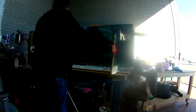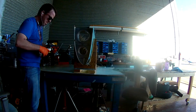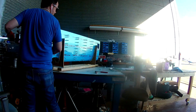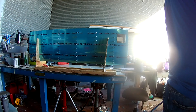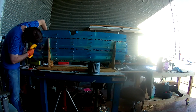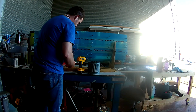As I put the ribs in — you put the skin into the holder, put the ribs in, click it on. As I'm doing it, my mind is flashing back. It's kind of like a war reflex: oh God, do I have to mix sealant? No, I don't. I mean, don't get me wrong, I like the sealant, but Jesus. So you put the ribs in and then you slide in the J-channel. You have to line up that pre-drilled hole that you made earlier and click that in place. The line that you've drawn across the flange should appear in the rivet holes along the skin. When they show up in place, you make sure it lines up, drill a hole, put a cleco, drill a hole, put a cleco. And that's what I do here ad nauseum.